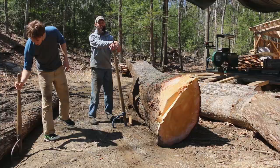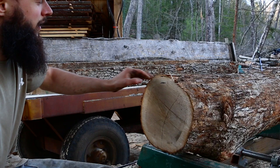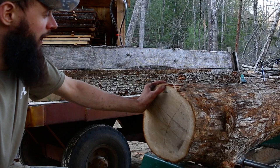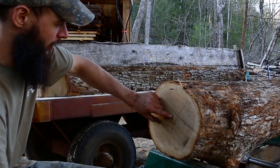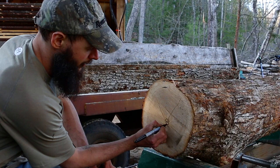This is the bark - this upper part. And right to here, this is the sapwood - the actual living part of the tree. This is where sap's going up and down, and there's a high moisture content. So this part you don't use for woodworking. It's very rot-prone and isn't as strong as the heartwood. And then this is all the heartwood - the darker wood. And then this dot is the pith - the very center of the tree. You want to eliminate about that much around the pith, because that's also really rot-prone and it's unstable wood.